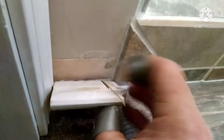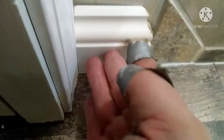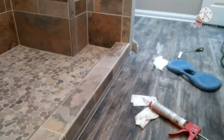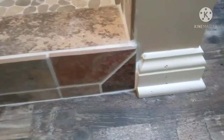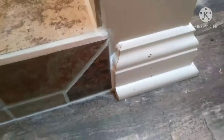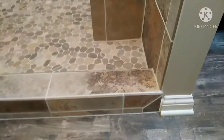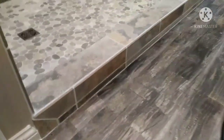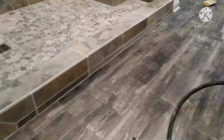I got the tile part cleaned off, and then I'll take my baseboard chunks that I already cut and get a couple nails in those. Get my little piece of shoe molding on there too, and then I'm going to caulk between the baseboard and the tile on both sides. You can see the silicone color match there — it's still kind of wet. Then I took my painter's caulk and caulked between the tile and the baseboard. I have to touch up the paint and fill the nail holes, but that way the floor can move a little bit and it's sealed up real good because these vinyl plank floors need to expand and contract.